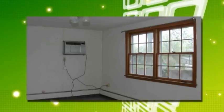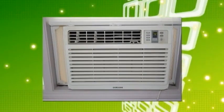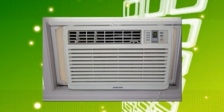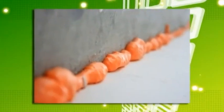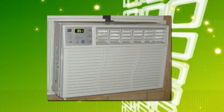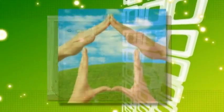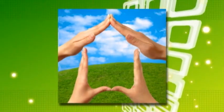Window and wall mount air conditioning units are lifesavers for many people and they've become more energy efficient than ever before. But despite all the improvements, the caulking and weather stripping around these units can become old, worn, and deteriorated. Look and feel for air coming in from around the frame and check the unit twice a year. Spending a few dollars and a little bit of your time can save hundreds of dollars over the long run.